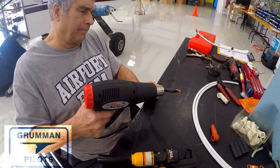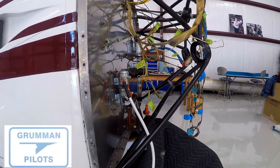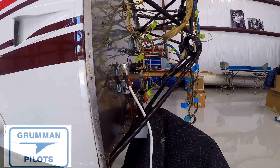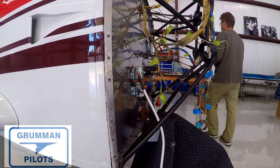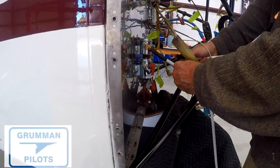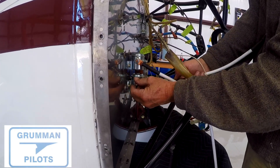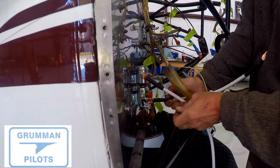That's about how you make an aircraft battery cable. Here's a quick shot of the tools used. No job is really complete until you see the results of your action, so here we are trying the new cables on the airplane. One is being hung on the starter relay because it goes to the starter — it's a 43-inch long cable. It's nice when you can make up a cable like that and then see the effects of your work when you put it on the aircraft. You want to check that the clocking position is right, all new hardware, then come with a wrench and make it all tight.